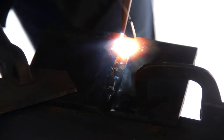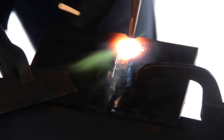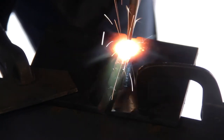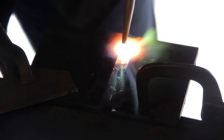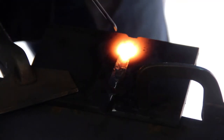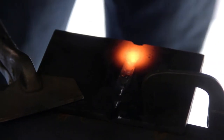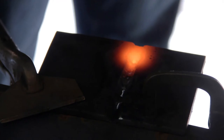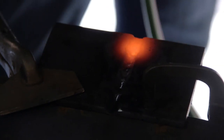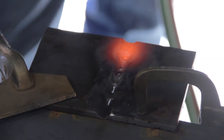It's a very tedious process, but for guys out in the field who don't have a welder on their truck, this can be a lifesaver. If you've got a leak on a pipe — say a water leak — and it's 10 or 11 o'clock at night, you're on call on the weekend and don't have access to a welder, you can utilize this oxy-fuel welding to repair that leak. Now I'm going to shut my oxygen off first, the gas off last, and terminate my flame.